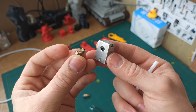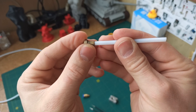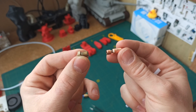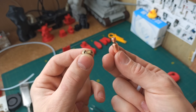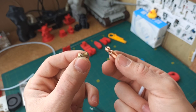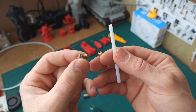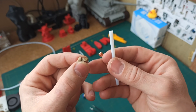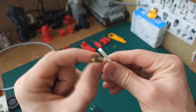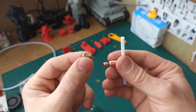There will be blobs and the print will stop. If you cut it straight and assembled correctly, nothing will leak anywhere — no need to apply any paste or wind PTFE tape. By the way, dear beginners, I initially recommend you replace the teflon thermobarrier with a bimetallic one, because it works with absolutely all types of plastic. It doesn't fear overheating, unlike teflon, whose critical temperature starts at 255°C. For example, if your PIDs are poorly calibrated, the temperature drifts up and your teflon gets slightly burned, deforms, the hole narrows, and a clog appears.